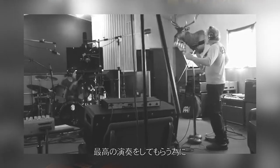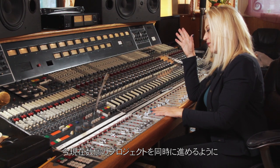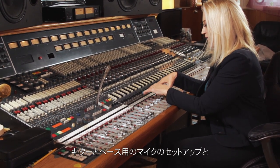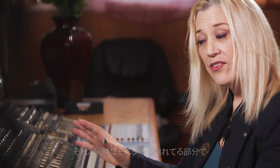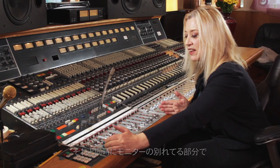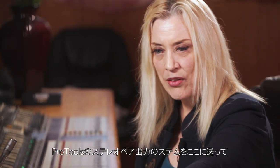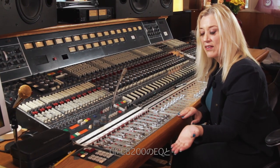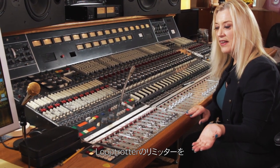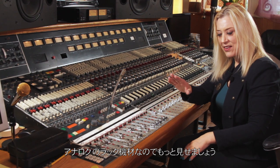It's a much more comfortable environment for musicians to give me their best performance. Right now on the console I'm set up to do a couple different projects at the same time. I've got mics set up for guitars, bass, and lead vocal. On the split console in the monitor section, I have a hybrid mix returning — stems coming out of Pro Tools on stereo pairs. I'll be able to do this mix quickly by putting in a stereo bus insert: the GML 8200 EQ and the Loop Trotter Emperor limiter, which is analog rack gear.